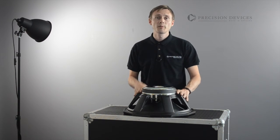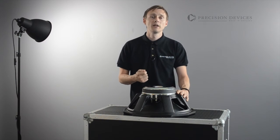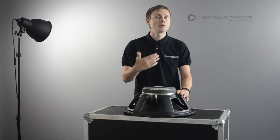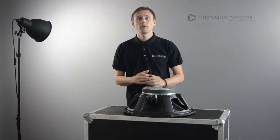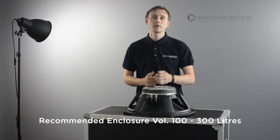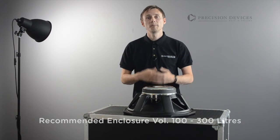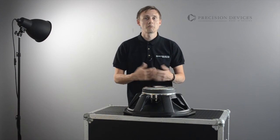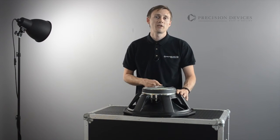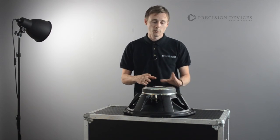The 184C01's performance characteristics can be optimised by bass reflex loading. The excellent definition and response speed at the lowest of audio frequencies make this drive unit eminently suitable for the bass component in monitoring systems. However, the driver's versatility means that it is also at home in traditional horn-loaded applications, offering tight punch and defined bass reproduction across its working bandwidth.